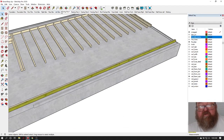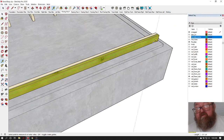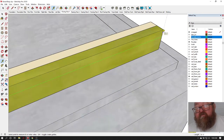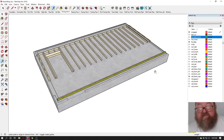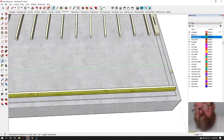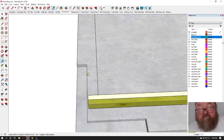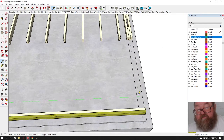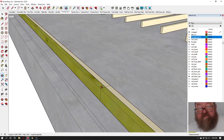So this building is long enough to where your next plate would go all the way to the end, okay? If you wanted to get technical and you built your slab right, it would be 10-foot 3. You'd have a 16-foot piece and a 10-foot 3 piece there, because this measurement is going to be 26 feet. Did I measure from the right spot? So it would go from here to here. Yeah, 26 feet 3, which was 16 feet and 10 foot 3.